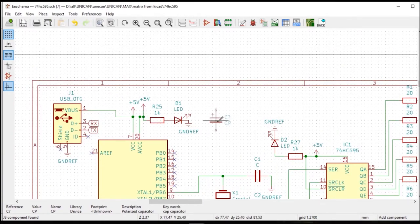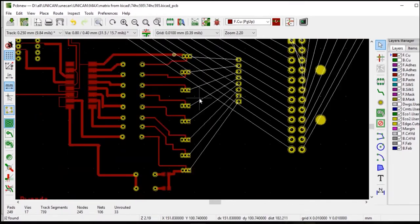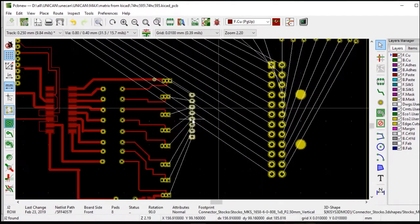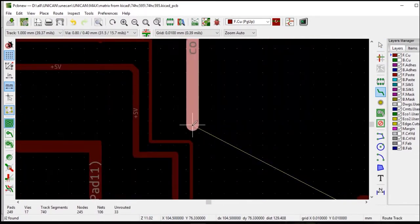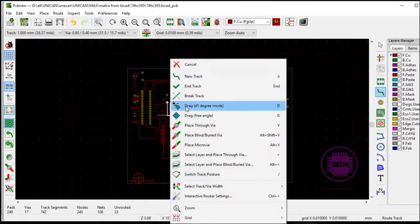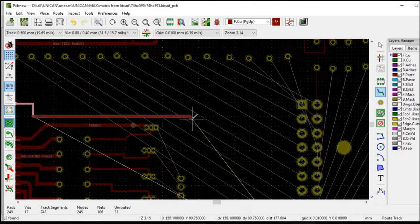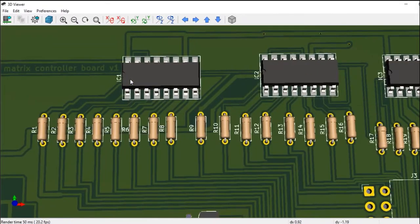And on the PCB layout, I used two different tracks, one with 0.25, another with 0.5 mm² for the cross section. I respected all the connections that would facilitate me adding jumpers and not vias, because the PCB I have is a single layer. This is how it looks in 3D.